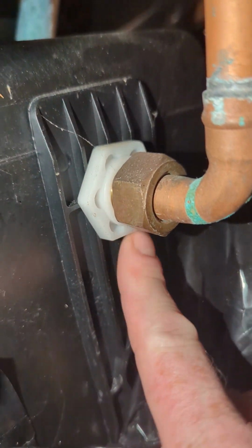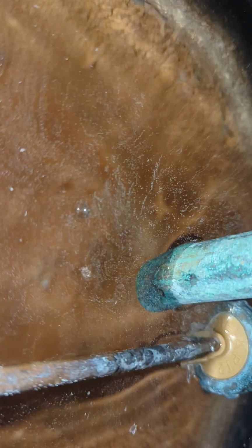It's not that much of an issue, but it can cause a leak here, and it's actually a contravention of the water regulations, as water from the heating system can in some instances enter into your cold water supply in the house, and contaminated water can get into your drinking water supply. It's quite unlikely, but it can happen. That's why it's important to have this overflow at the correct height.